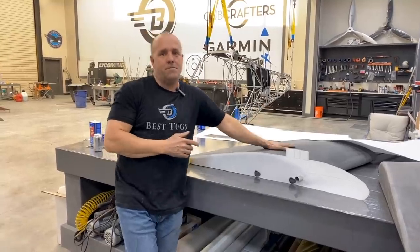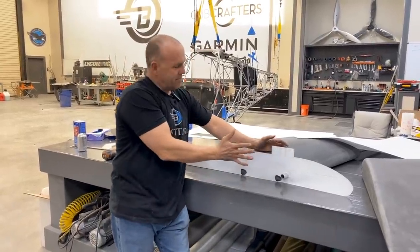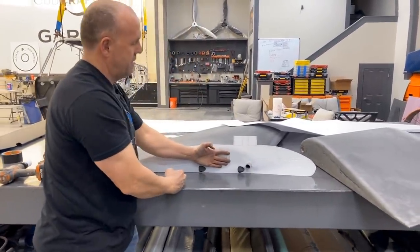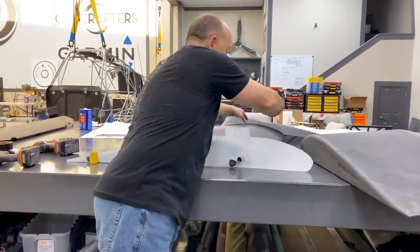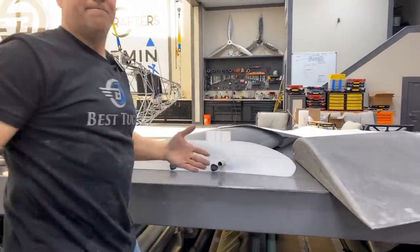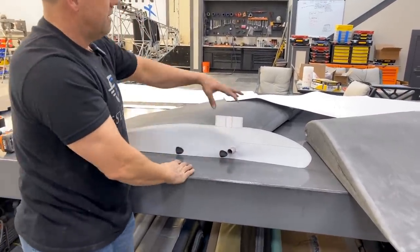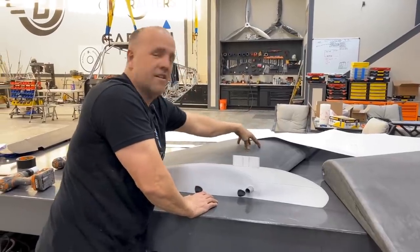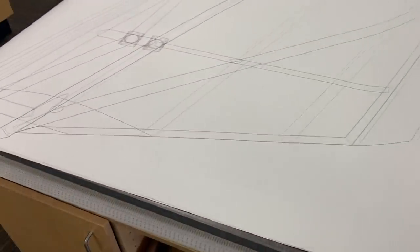This is for how the metal will pass out of the carbon fiber mini wing. I've got a template for this side — it looks a little funny, but in the computer it 3D models a flat plane. Since the gear leg is raked forward, this line is actually representing that side in a perfect 90-degree plane, showing the angle across to the back. These represent the shock mounts, and when I put a template on the other side of the gear leg, I can put a line between the two. I've also got a top-down template showing the metal frame inside the mini wings.